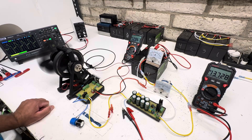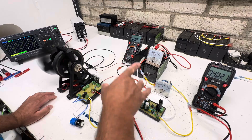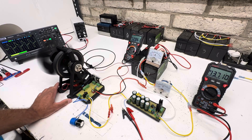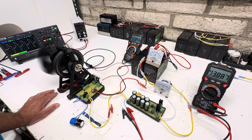Now we're using 300 milliamps and pulsing back 600 milliamps about once a second. You can see how the battery sagged a little bit, so even though this is probably your best speed and performance, it's not really regenerating the battery like it did when I first had it tuned. This is considered resonance - I prefer multi-pulses myself, you get a lot more energy back. This is probably right around 50% energy return or more.